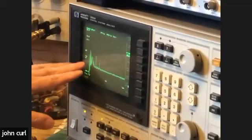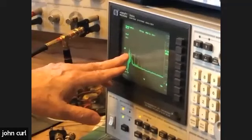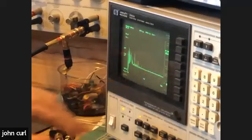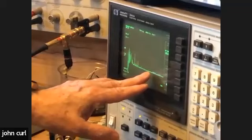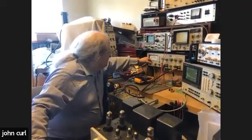First of all, I'm seeing the 1000 cycle, that's the test tone. That's the second harmonic, and that's the third harmonic, and that's the fourth harmonic. And that's the sixth harmonic. There actually is a little tiny, tiny bit of sixth harmonic. No seventh, nothing. Now remember, it's only at a watt. That's the old listening place, that we were at before. Now, this is a big amp, a watt. I mean, man, that's easy. Right? So let's go to something else.